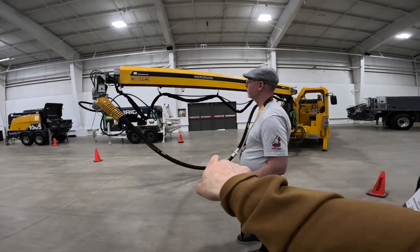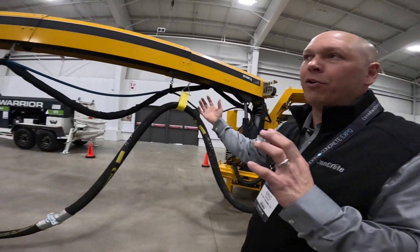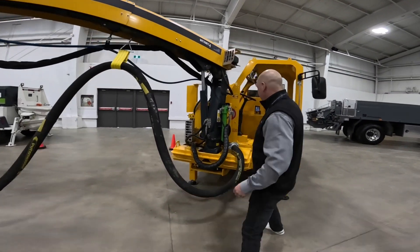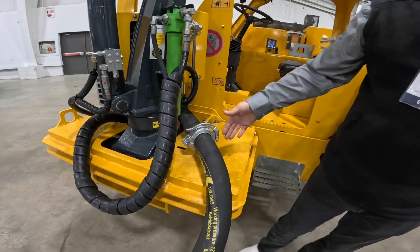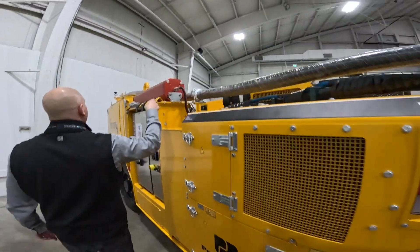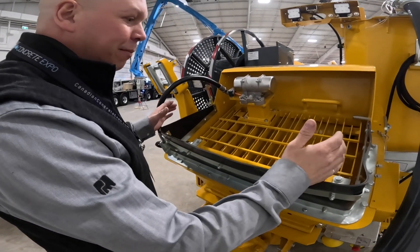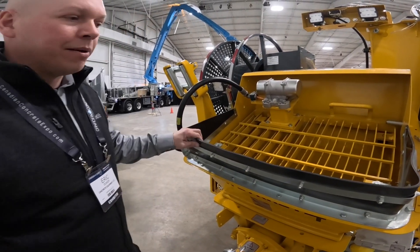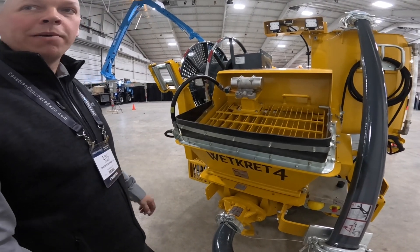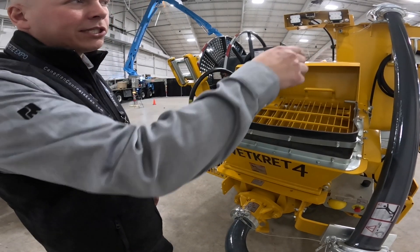This is two-and-a-half inch line hose. There's a pump unit on this thing too. The line dangles down here — you can imagine shotcrete spray gets all over everything on this unit, so everything's easy to remove. It comes off the reducer on the side of the pump. This is like a Putzmeister P730 or TK30 flat pack with six-inch material cylinders. It's all timed with the shotcrete part — there's an accelerator pump for adding accelerator to the shotcrete at the nozzle, an air compressor on board, and the pump kit. They're all timed and programmed by the computer on the side.